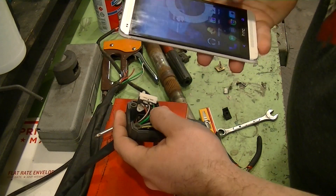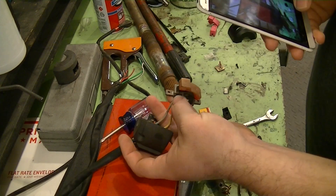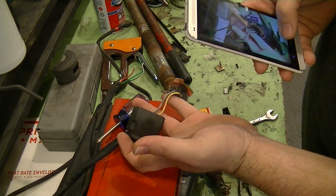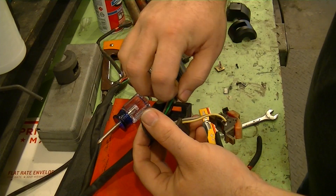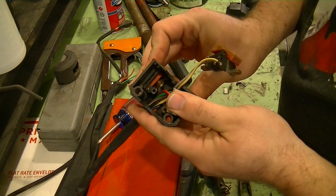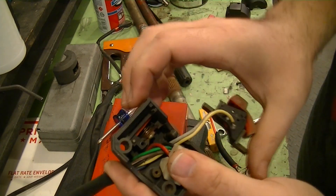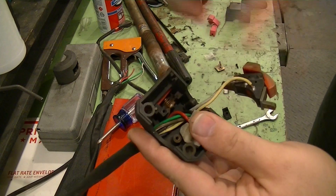The entire idea is that I can grab pictures of this kind of stuff as I go. Makes it super simple to put it all back together. This switch is just a contact switch, so it should matter a little less as far as having this together. Now I can snip these wires off and desolder them. As far as the starter button goes, there's a plate that sits there — the spring holds it away and then when you touch it, it completes the circuit.